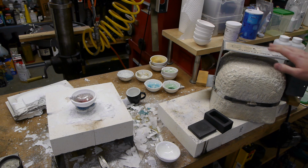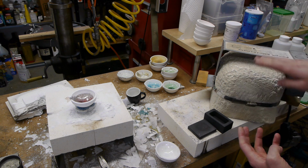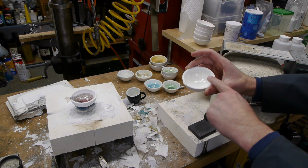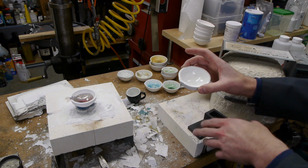If you have a gas-fired kiln, the exhaust from your flame is actually reducing. There's probably quite a lot of carbon monoxide in there. And at these temperatures, that carbon monoxide will find oxygen molecules and react with them to make carbon dioxide. And it's so reducing at these high temperatures that it will actually pull oxygen out of the glass and prevent it from being photochromic. I think commercially you could probably get around this by having a really big crucible inside your gas-fired kiln, and it's only the surface layer that's affected by the reducing atmosphere. The trouble is, if you're using small little melting dishes like this, the amount of surface area up here is high enough that if you've only got 100 grams of glass in here, it's basically all going to be affected by the atmosphere in the kiln.